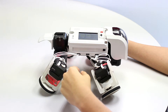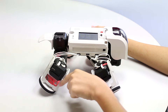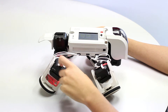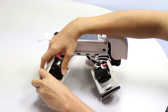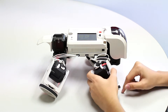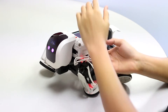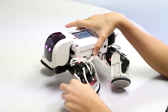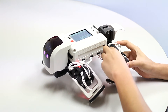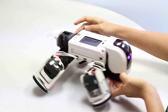This is the first time frame. Since the robot will be moving in this direction, this leg has already pushed the robot forward, so it will have to lift. For this leg, since it is lifting to the starting position, it should go back. This leg has already pushed, so it will lift. And for this leg, you have to go back to the landing position. So this will be frame 2.